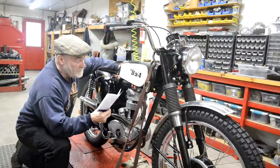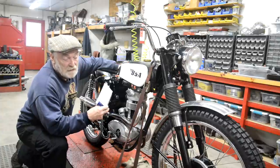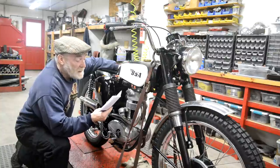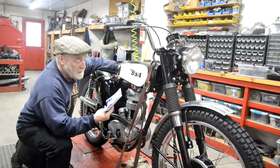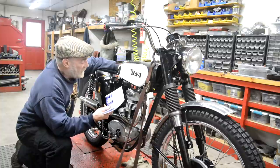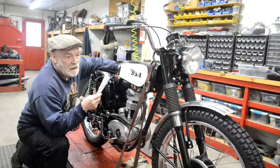And it says, a spark isn't always visible when kicking the bike over, and this is normal. Maybe so, but it isn't helpful when you're trying to check things. The CDI produces a high voltage, short duration spark. This intensifies as RPM increases, as opposed to points which produce a low voltage, long duration spark. That's why I see things like Can-Ams with a Rotax engine.